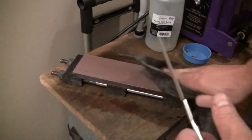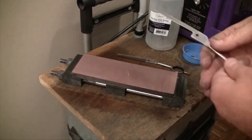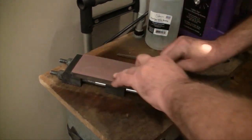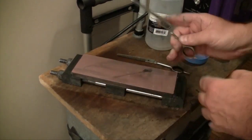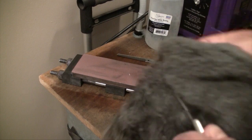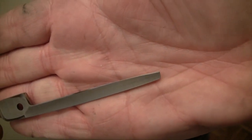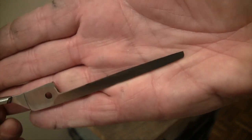I like to wipe the stone down again as well, just in case there's any residual burr left on there, while making sure I'm not digging into the stone and embedding burrs. Finger over the screw hole on the right hand, left-hand first finger in front of that, with all the pressure coming from over the hole. We're going to go back and forth, making sure we have a well-established ride line, come to a complete stop, then lift off and wipe it down. We can see within reason that we have a good solid nice flat ride line. We're ready to do our polish.